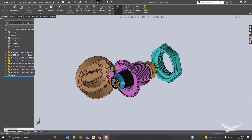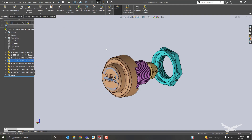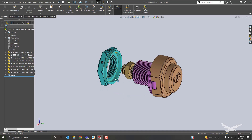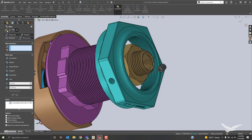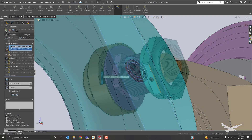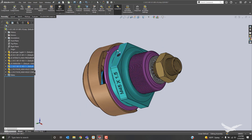When creating the base feature of the assembly, I wanted to prevent the assembly from loosening over time due to vibration. I used threaded features to add a thread to the base and its matching mounting nut. A removable one-time crush shim was added to securely wedge the base assembly into the bumper when the mounting nut was tightened down. Set screws were incorporated into the nut to purposely deform those threads to prevent the nut from backing off and preventing the assembly from coming loose over time.